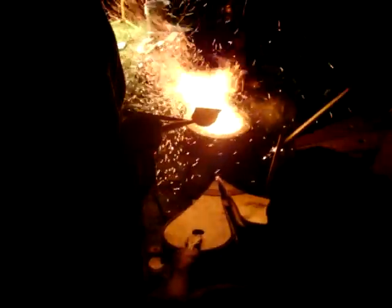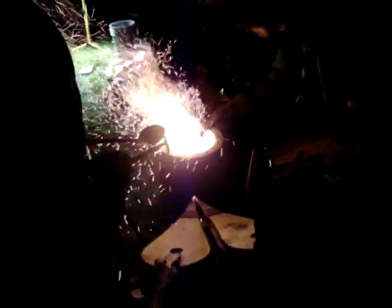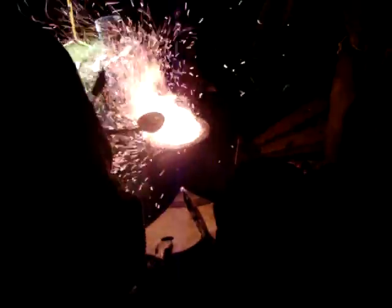You're gonna want to go towards the sticks. You just dropped it there. So why do we move the bellows away? Because the heat will — since you're no longer putting air into it, the heat will melt. I've still got some more tin yet. I think we put it in too fast. It solidified because of the temperature drop.